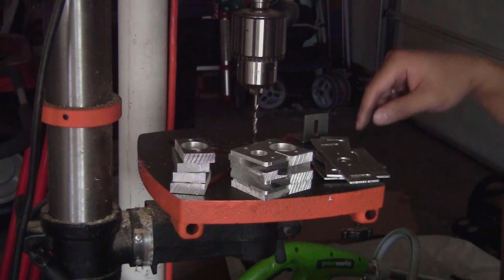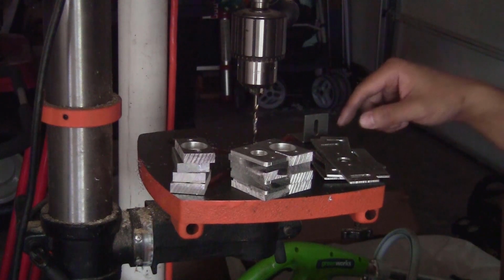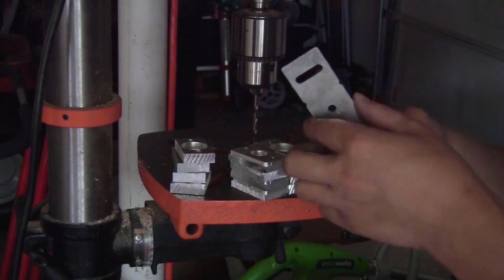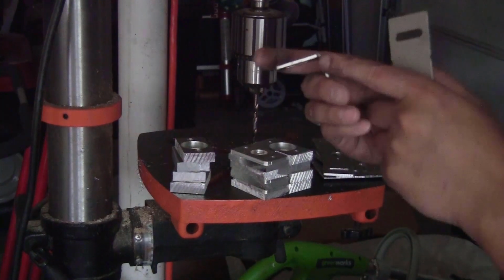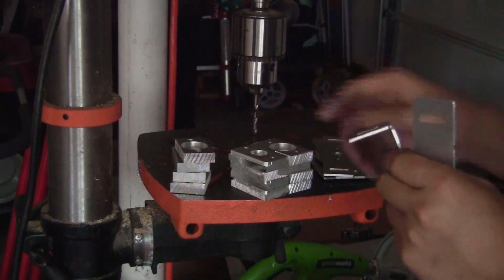And the other thin pieces that you will need to put together the bearing blocks or to fix them on the machine. On most of the thin pieces, you will see the notches like this. You will need to bend the piece at the notches like this, like 90 degrees. I will show you how I do this after I make the thread on those thick pieces.